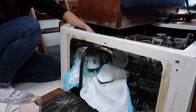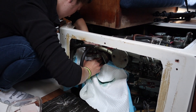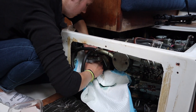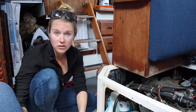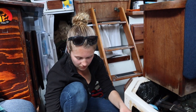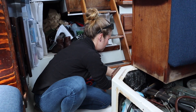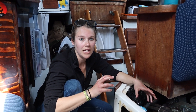It's so slippery. Once the O-ring touches, the filter usually says how much further to turn it — this one says an additional three quarters of a turn. It is a good sign that the old filter is looking gunky. We don't know when it was last changed; we haven't changed it, so it's probably overdue. By putting a new fuel filter on, it introduces a lot of air into the system, so now we are going to bleed the lines of any air.